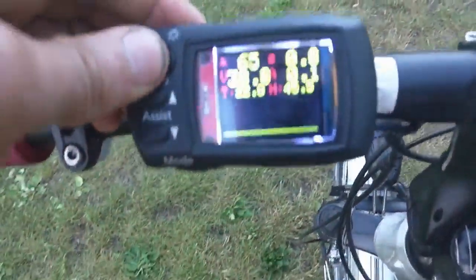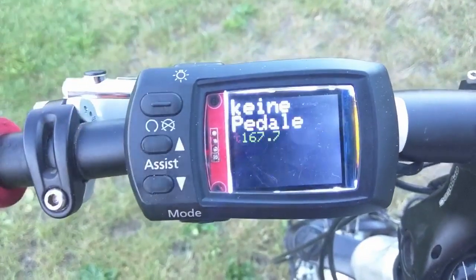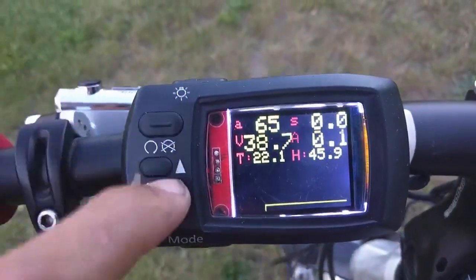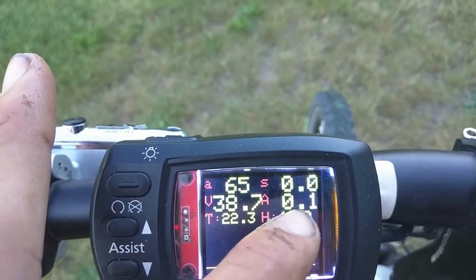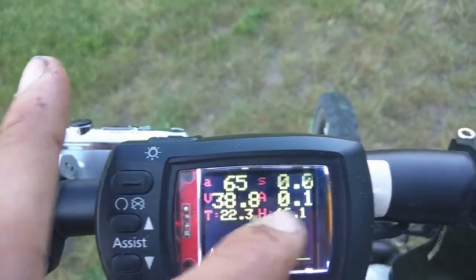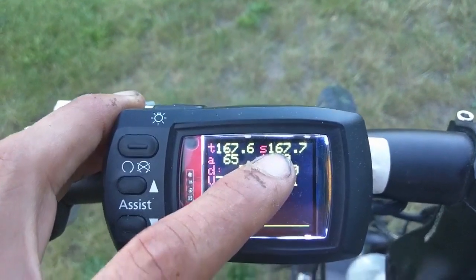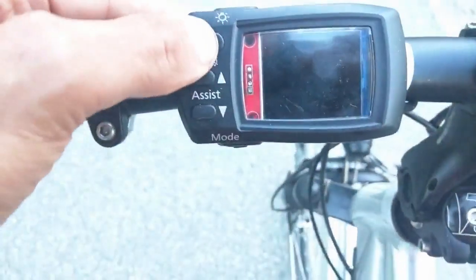Here is the final Panasonic open-source drive with serial ports and DTR to flash any Arduino Mini inside. When you turn it on — please don't move the pedals — you can see the display. Below you see the torque. This is assist mode; here's the speed, the battery voltage, the current and amperage, the temperature, and humidity. There's also a developer mode showing torque with no pedal.